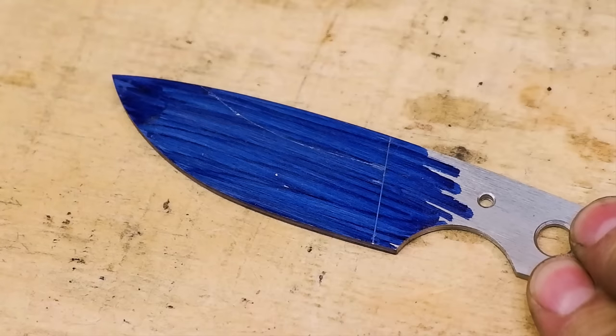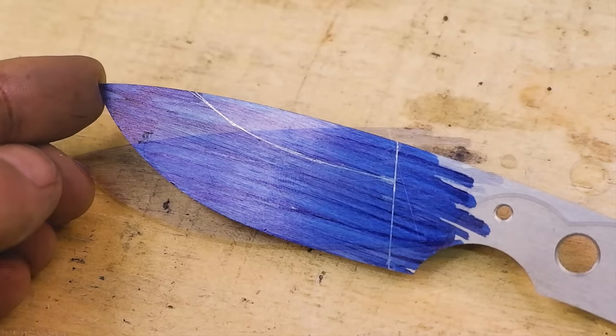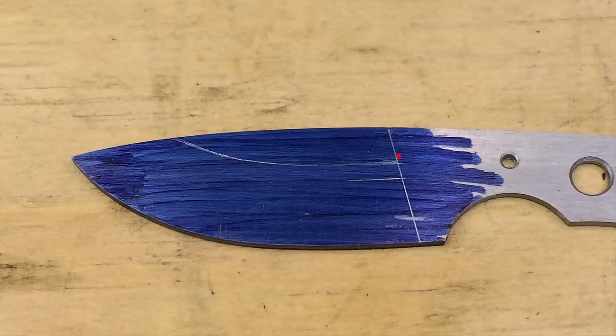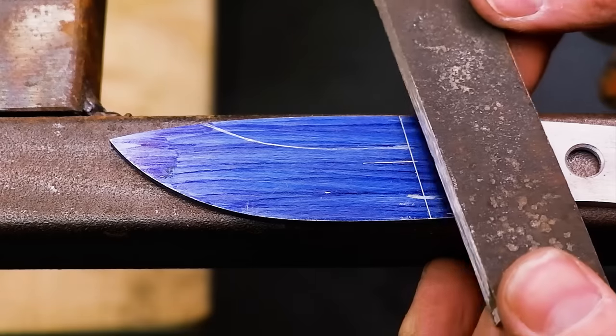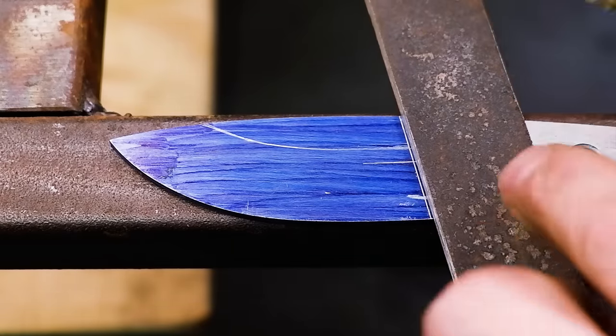As I mentioned earlier, there are two ways you can approach your plunge lines. We have two marks on our blade currently. If you file your plunge line to the top marking, you will end up with a sharp corner at the top where your plunge line merges into the bevel. If you file your plunge line to the bottom mark, and you file your bevel past the mark up to where you marked your bevel lines, you will end up with a slight radius where the plunge line transitions into the bevel area. I prefer the radius as it flows better with the design, but that is personal preference, and you can choose either way.